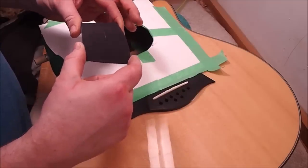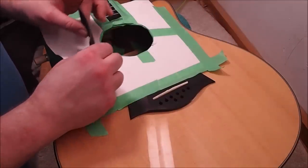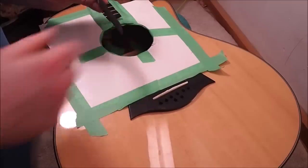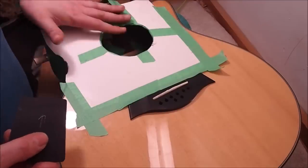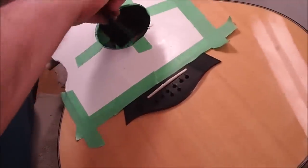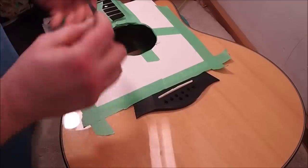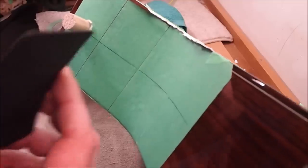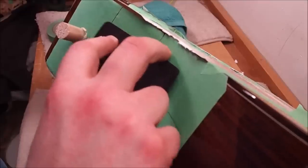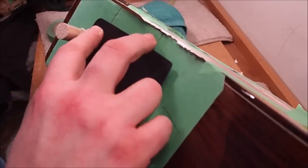It's got good gap-filling capabilities, and because it's difficult to mate these two surfaces together, I'm going to be clamping them using a whole bunch of magnets inside and out to hold it in place. As you can see, I've taped everything off — I want no chance of getting epoxy on the top anywhere. You also have to rehearse your movements to see exactly what you've got to do to get it in position when the time comes. I'll be wearing gloves. To make sure I get the support in the right place, I've got a magnet running through that'll act as a positive stop for the leading edge of it, plus a piece of tape on the other side as a visual cue.